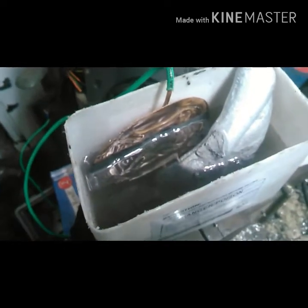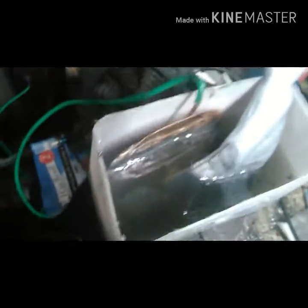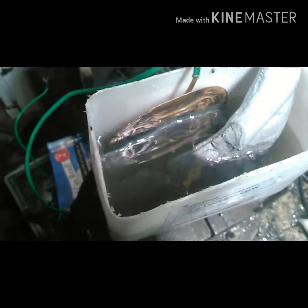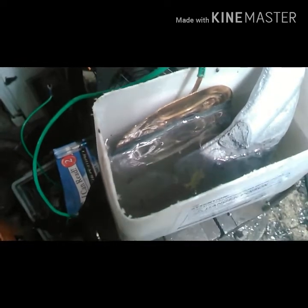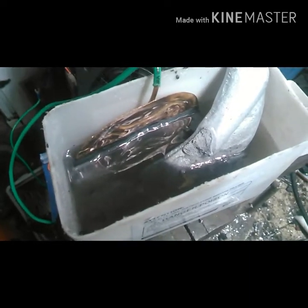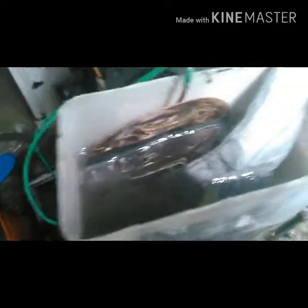So that is how I'm going to make my zinc powder. You just take that off, take this out, rinse it off, and then scrape the zinc off — and then you get like a zinc sponge, which will turn into zinc powder. Using this method, it basically takes from one and puts it on the other endlessly. I'm using an ATX power supply that I made, and I just have the 5-volt standby as the power. It's creating a little bit of hydrogen, but not very much. But yeah, as you can see, it works.